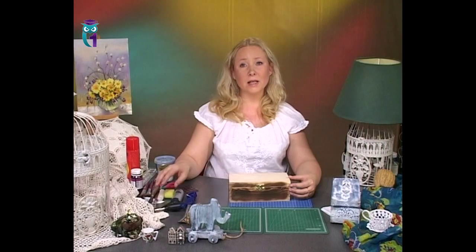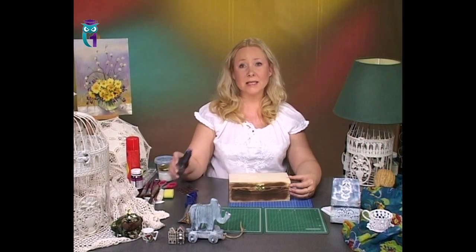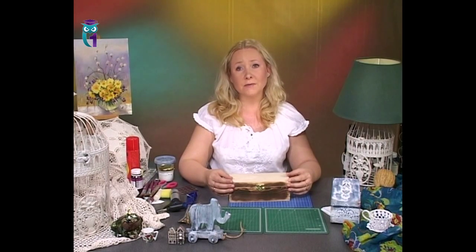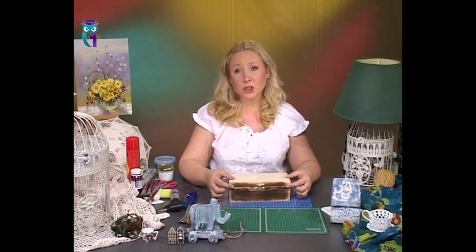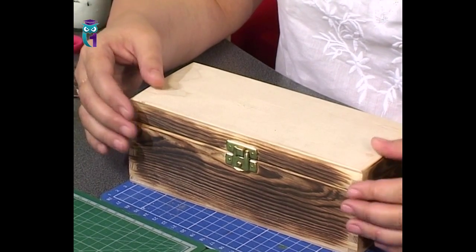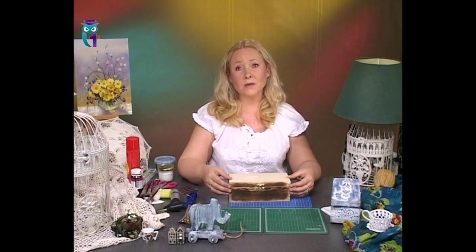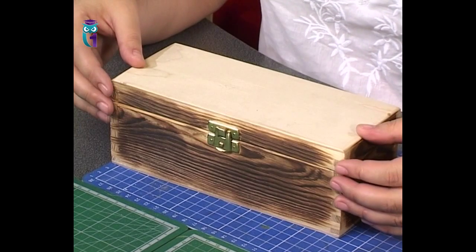You can use any gas torch for work, it's not essential. Here it is important only that the wood burns down, and also important is the degree of how you will burn this wood, or rather, if you burn strongly, the brushing will be deeper. In other words, the product will be more relief. Here all depends on your taste and imagination, and on the product which you are going to decorate in this technique.